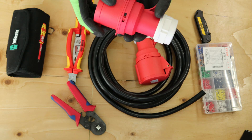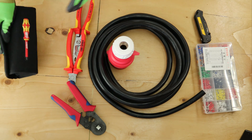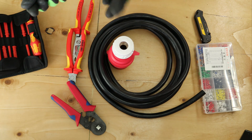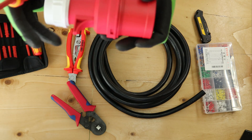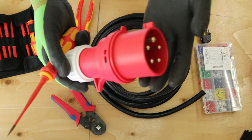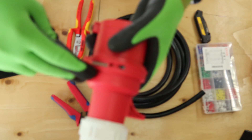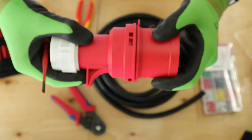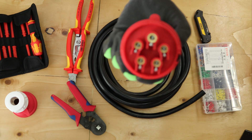To start, we need to open up this male end or the female end — choose one end. I will start with the male end first. You need a slotted screwdriver. It depends on which type of commando socket or plug you've got. For this one, you press on the black area, press it in, and then you can twist the entire case open. Some of them you need to unscrew from the inside, but for this one it's simple.